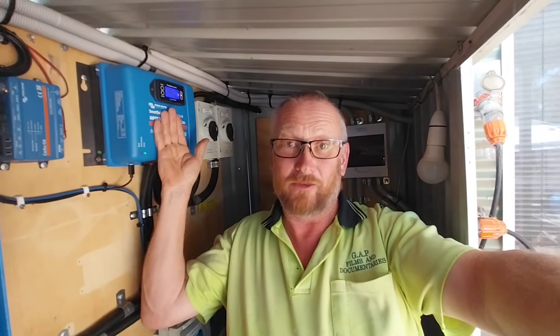So what I did is I took out that second controller, so we're running everything on this first controller. That kept the voltage the same but actually took a lot of that ripple away. We still logged one of the ripples, and it was happening when we were sitting at 100%. So it's not happening under load — when the inverter's running and pulling load, that's not when we're getting our ripple. The ripple is happening when our batteries are sitting at 100%.